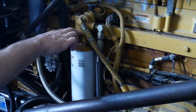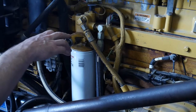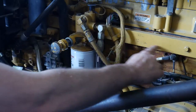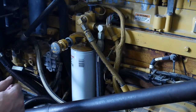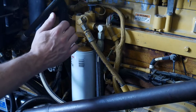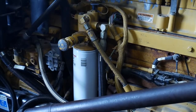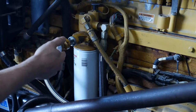If you're quiet for a second, you'll hear the valves in the base of the hand transfer pump creating the draw, then pushing fuel out through the filter. It then pushes out of the filter into this rail right here, which pushes it into the gallery in the head to make it available to the mechanical operated electronic unit injectors. You can hear the click.